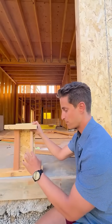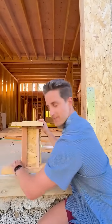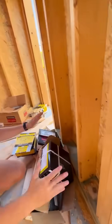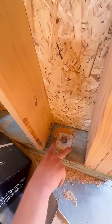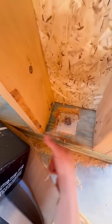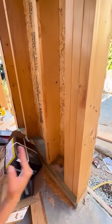That gives us enough bearing surface to prevent the wall assembly from lifting up. On this wall pier, we have two anchor bolts with three inch by three inch square washers, so that's keeping this whole assembly from sliding left and right and also from lifting straight up.